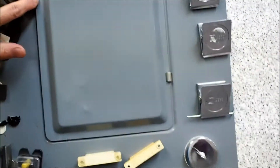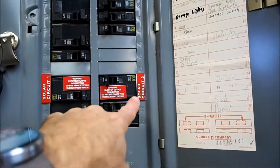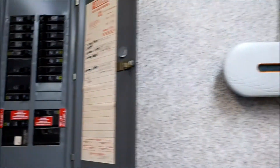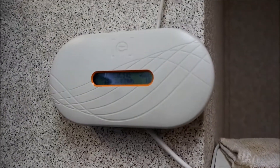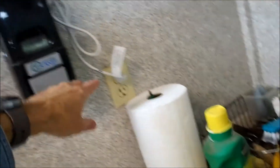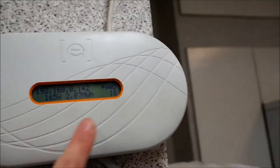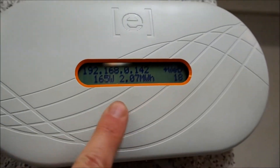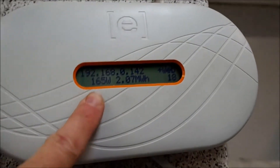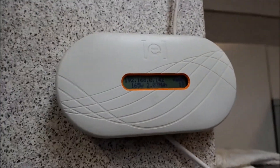I love magnets. In here you can see where the solar system ties into the grid through each of these circuit breakers. Right next to it, you can see the little box that Enphase has — the Envoy — that takes information from the solar panels sent via the power line. This plugs into a regular outlet. And this box decodes that power line encoded data and monitors the output and health of each of the 18 solar panels. Right now, late in the day, we're generating 165 watts. That'll get up to about 4 kilowatts on a sunny summer day.